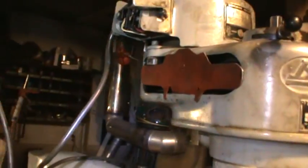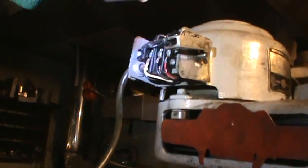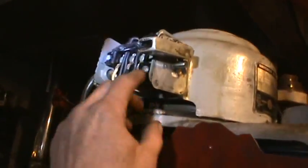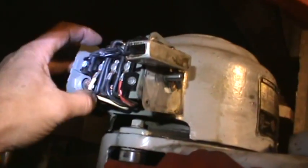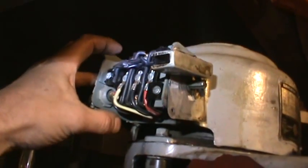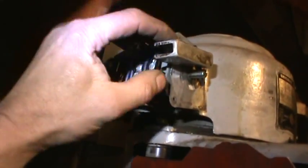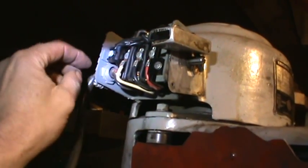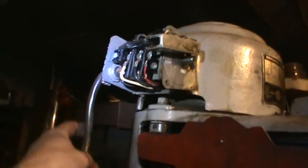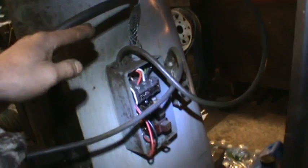I started just pulling off some of the panels. It's got a cord coming over from the other side and the forward and reverse switch - which you're going to end up not using. But these are the three phases right here going into the motor, so I may just take these three wires, mount them up there. That will nullify this switch, and I could use this wire going to the controller.